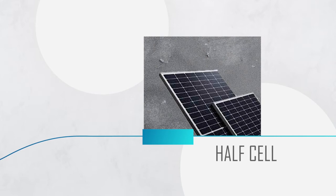There are different kinds of cells available, each doing something slightly different to increase the efficiency of the module. First up is half-cell technology, which literally consists of individual cells cut in half and arranged within distinct halves of the module, connected together in parallel. This means not only is there more resilience to the effects of shading, but the reduced cross-sectional area of the cell means lower internal resistance and therefore fewer electrical losses. A half-cell module will result in a split junction box, with positive and negative tails connected to individual smaller junction boxes split one each side of the back of the module.